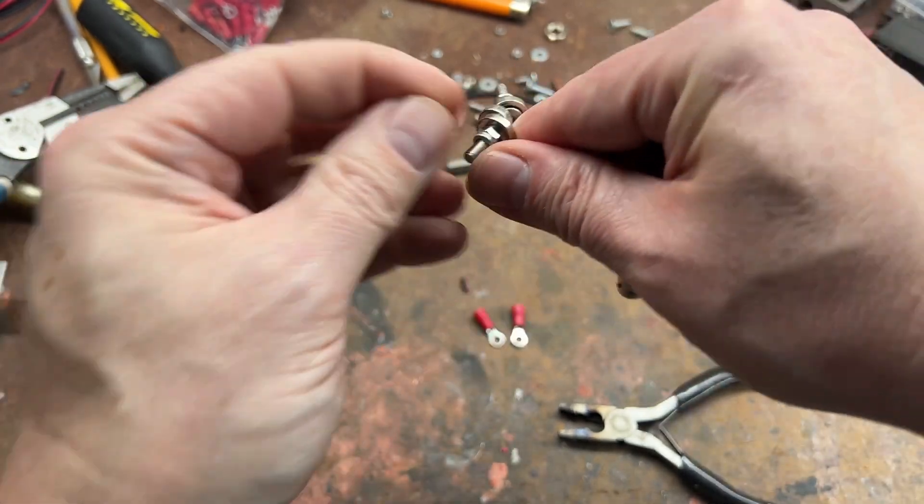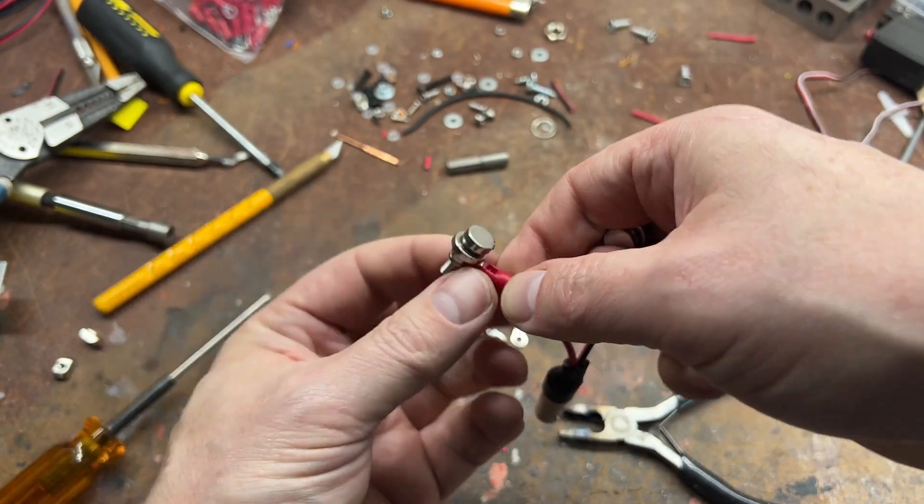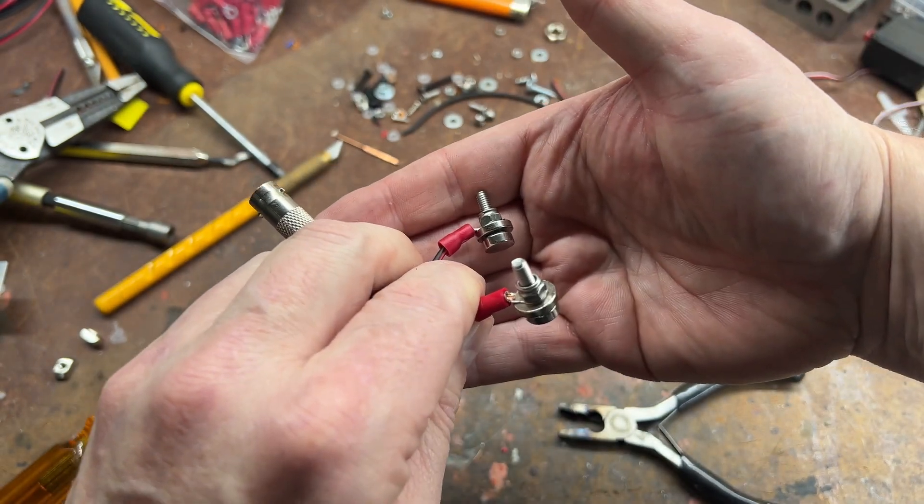After that you just need the backing magnet, and you throw that over top of whatever duct tape antenna you have and play around and tune it. One thing I've done here — you'll notice the legs on this pigtail are really long. Don't do that. Make them as short as you possibly can, because this wire ends up being part of the antenna.